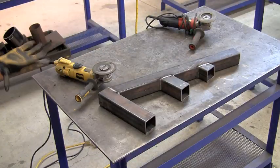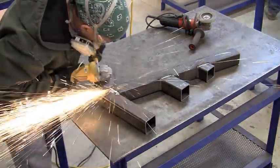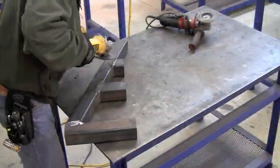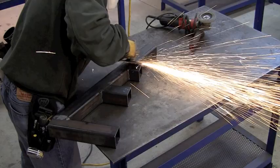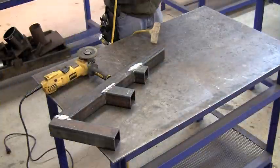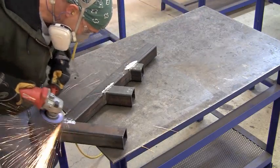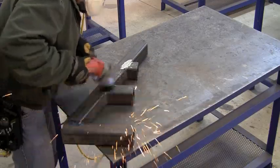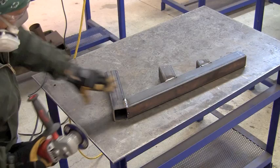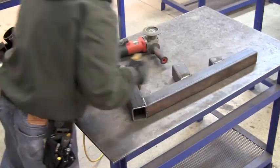Part's cooled off. We're going to grind that one side just so it sits nice and flat on the table. The welds aren't that heavy so it shouldn't take us too long — we're just going to hit it with the hard disk and then the flap wheel, blend it a little bit, and make sure we don't have any sharp edges on it. Then we should be ready to test fit it in the machine. We'll hit it with a flat wheel, check it on the table — it is pretty flat — and then we're going to go over to the machine.